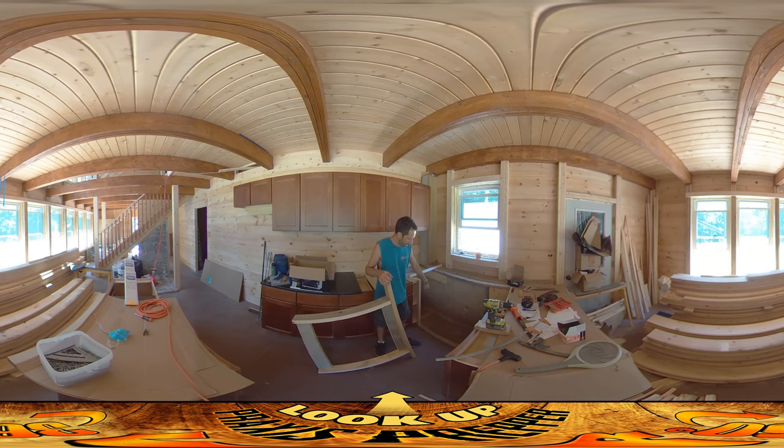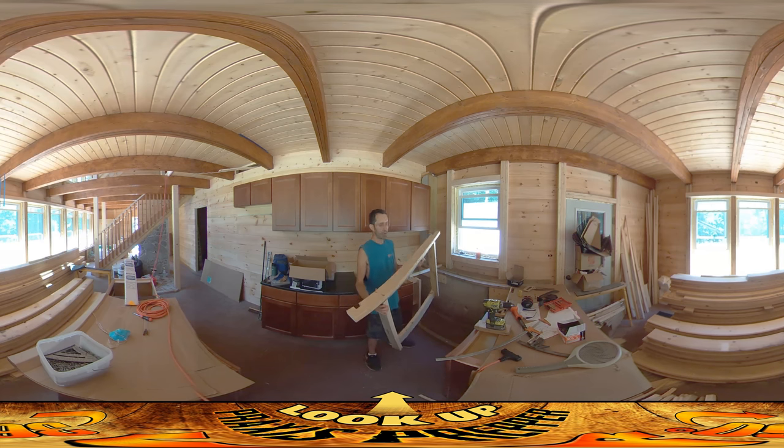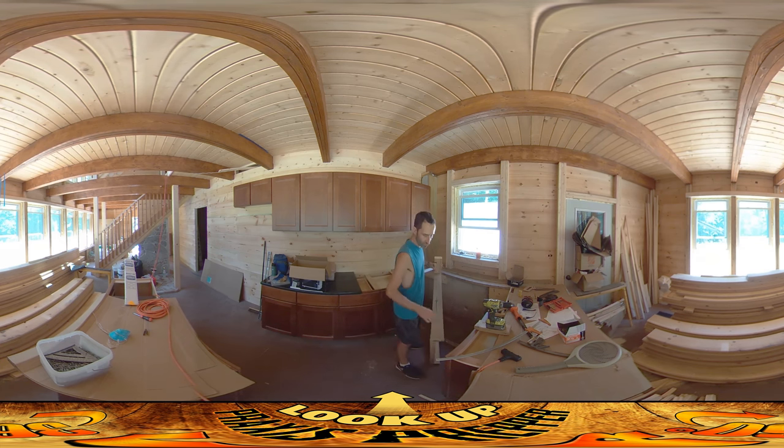From there I just kept doing a little bit at a time, keeping a little toe tuck area in there. This is the last piece to go in, and I want to talk about how I've been creating these. Whenever you don't have many boards with a lot of crisscrossing to hold the thing together, I like to use screws — they just grab it and make it a lot more rigid. As I was putting it together I was also using this clamp for any boards that have a little bit of a twist to them. You put the clamp on, clamp them down so they're nice and smooth and flush, screw them in, then release the clamp and everything looks beautiful.